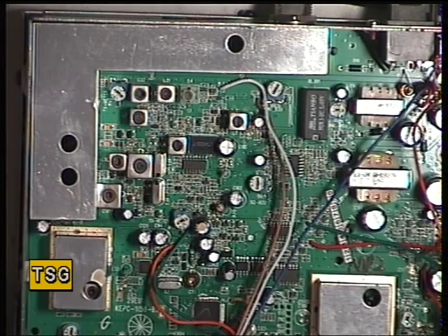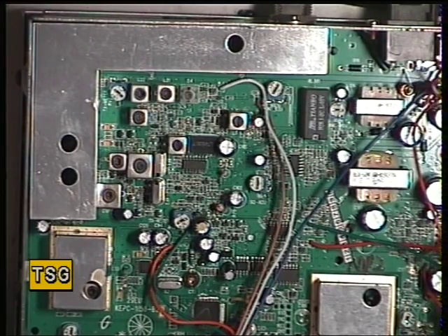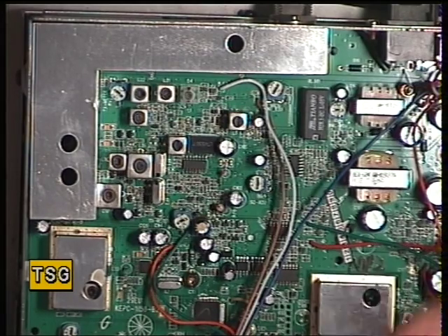Let's see if we can just peak that. We're on channel 20 on the UK channels because I'm only interested in the UK channels. If you wanted it to work better on the EU channels you'd tune on channel 20 of the EU channels. If you wanted it to work equally well on both, you'd use channel 1 of UK or channel 40 of EU. But we're only interested in UK channels, so it's channel 20 in the centre of the UK band.